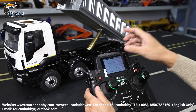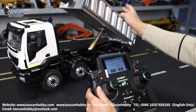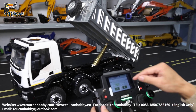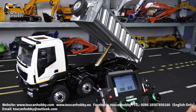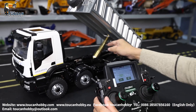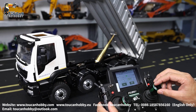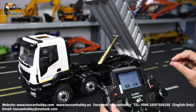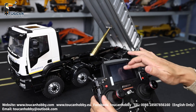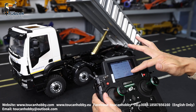For channel 2 — the pump — 50 percent is already enough to lift up and lower the bucket. If you want more speed, you can increase a little bit like 60 or 70 percent, but not too high — it may burst the hose. When driving with the bucket lifted, be careful: before you reach the end, slow it down and stop, because this one has a safety valve. Same when going down. That's the setting for the hydraulic pump.